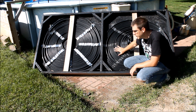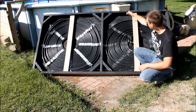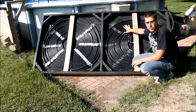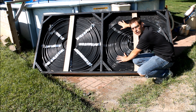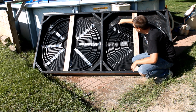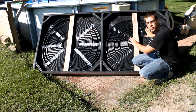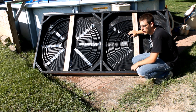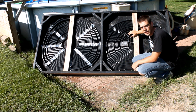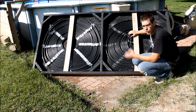This one is kind of falling apart. Once these things heat up, the hoses kind of slink down to the bottom. What I'd recommend is either put more wood bracing across here to keep the whole coil flat against the plywood, or use cable ties every couple of hose windings on each corner to hold the coil in place so it doesn't come apart. Using duct tape as I wound it worked great, and I had planned on removing it to make it look nice, but I ran out of time. It still works great — just doesn't look as great as it did when I started.